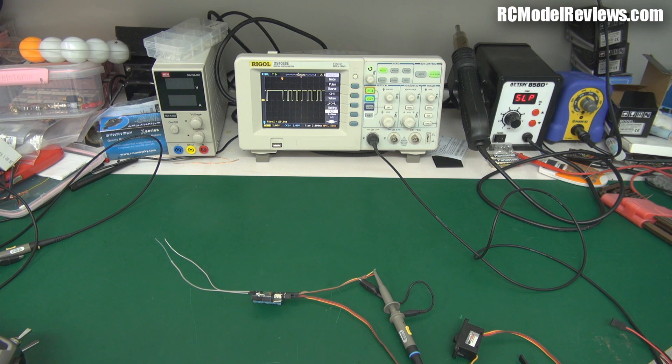That's the way we've done it for many many years, but now we have something called CPPM or PPM. That means that for things like flight controllers and multi-rotors, all you need is one single servo lead from the receiver to the flight controller board, rather than one lead for each channel. This makes the wiring so much easier and it's just really really convenient.